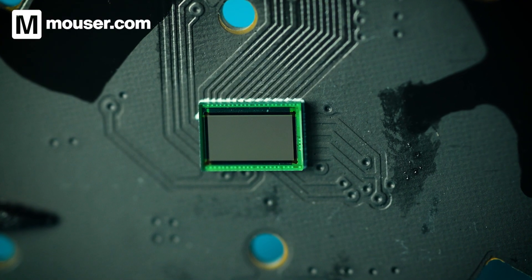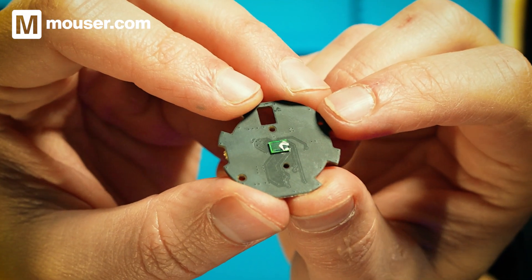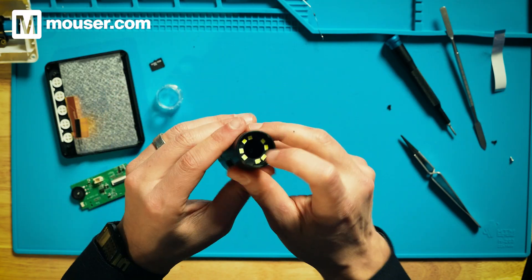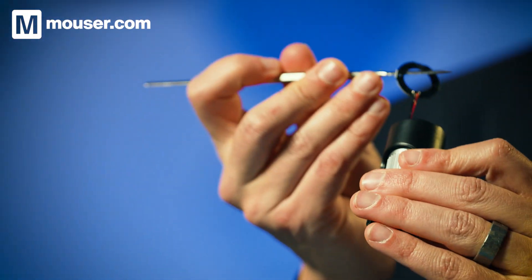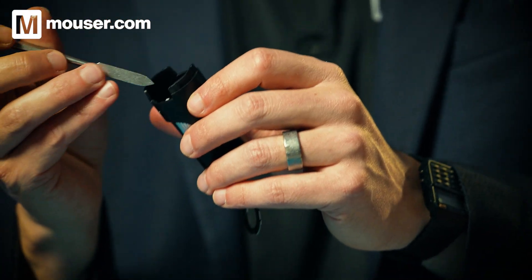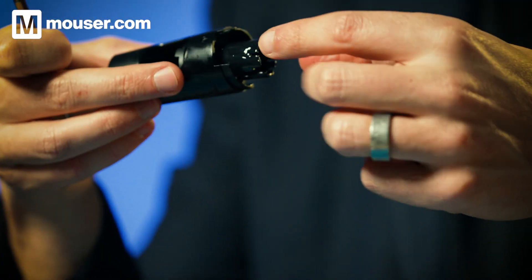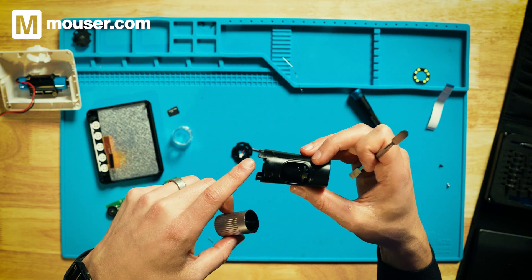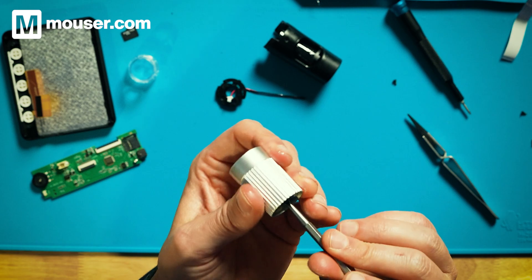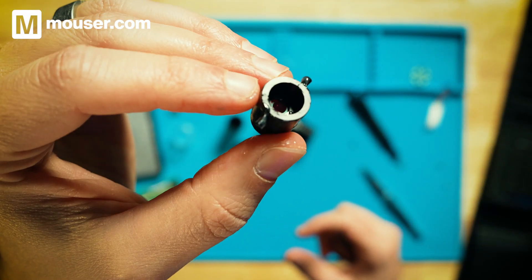There it is — look at that. I'm curious if we can pull it off the board a little bit and see the back. Sometimes these are very tricky to get off. We broke the cover glass a little bit — there's usually some sort of optical medium on the front to protect the sensor. The lens system seems very nicely enclosed. We have an LED board on the front, which pops right out. It all looks pretty press-fit. Here we go — it is so gross inside. This is just a mechanical cartridge slider on a screw system that pushes this part in and out. That's why you see all the grease, so it slides on itself. And then the lens itself looks to be just this tiny little bit on the inside. All the magic of this system is this lens into that tiny little camera sensor.